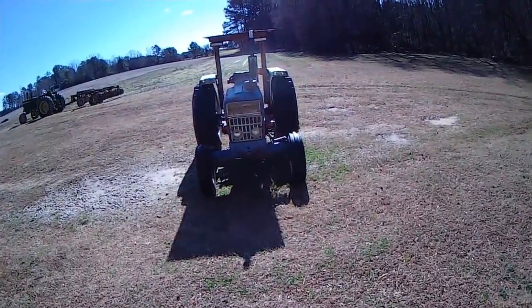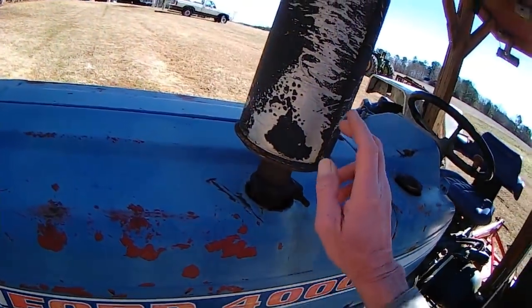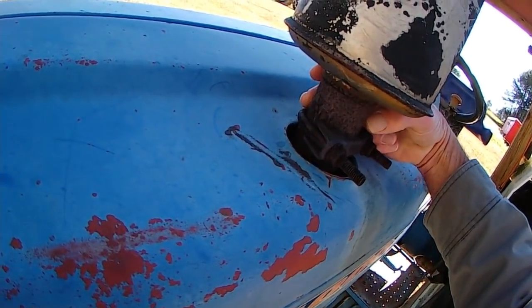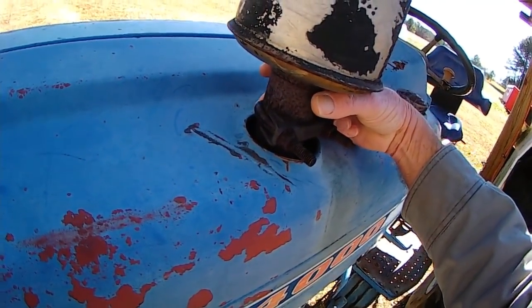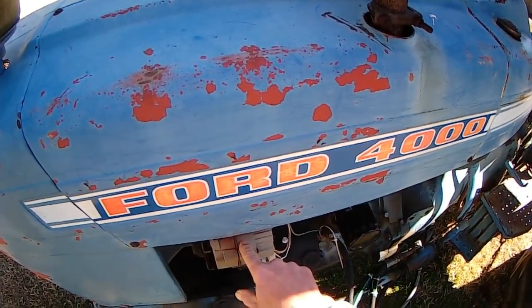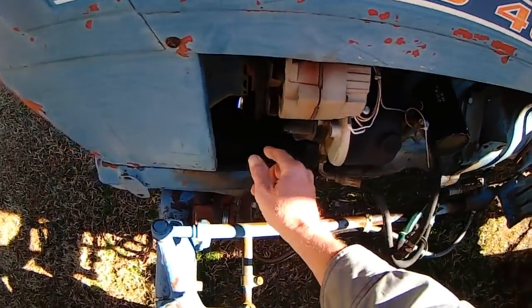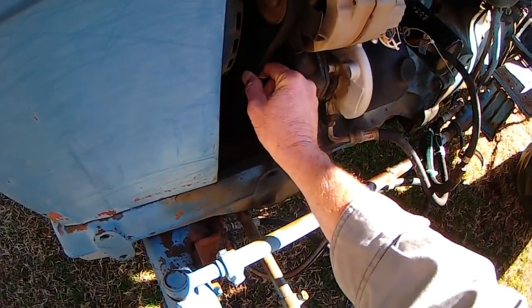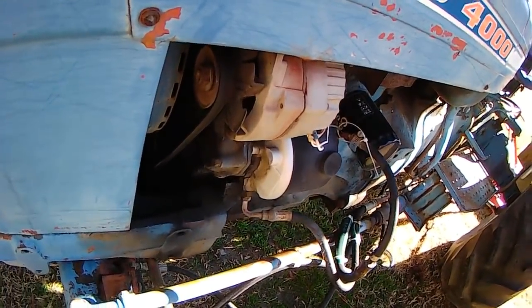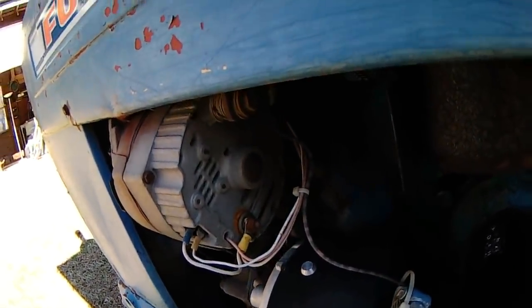Next project issue on this Ford tractor — I am dreading this with a passion. The way they put this muffler on here, as you can see, is a U-bolt style clamp, and the pressure applied to stop the leakage has got that classic dent right here. I've got to get this off so I can get the cowl off to fix what someone did here when they changed this from a generator to an alternator. A viewer noticed and pointed out to me that the belt is super loose.